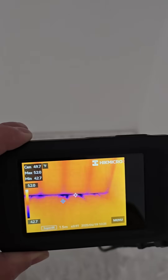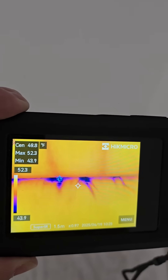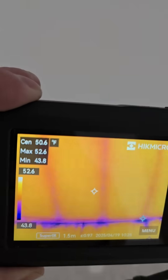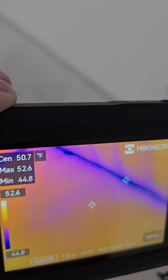I'm going to show you something — this is something I see a lot. That is air leakage. I have a blower door going. That is air leakage underneath that wall, this knee wall area. And it's not just there — we've got them all over the place.